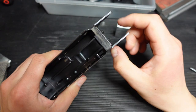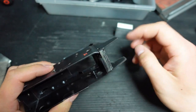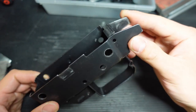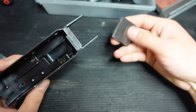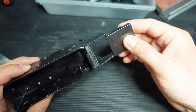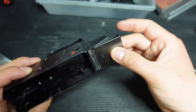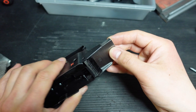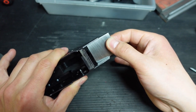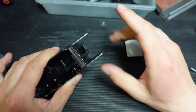All right, so first let's check the inter-ear distance, basically. This relationship defines how much rattle room or clearance the trigger housing has with the receiver. I'm going to use a 30 millimeter gauge block to help inspect that. We're just going to pass it through and see how much clearance there is. So we're not too tight, that's good. I'm feeling just a little bit of binding here. Quite a little bit of play. So this means that this interface right here is a little bit on the looser side.